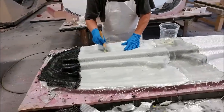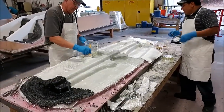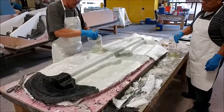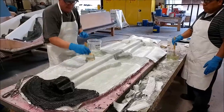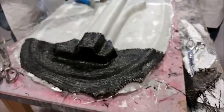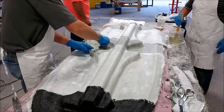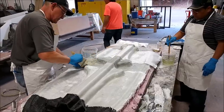Roberto and Chris are back in this evening, here putting the heavy layers on the mould for the front seat mounts. They're putting a mixture of glass and carbon fibre, and the reason they're using carbon fibre there is that it moulds more easily around complicated corners than the glass does — that's why you see the two different materials going on.